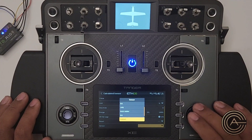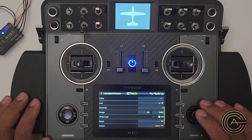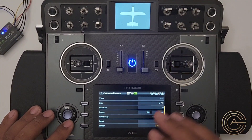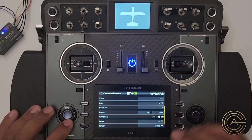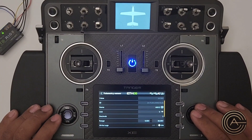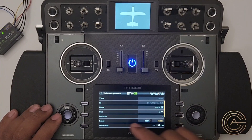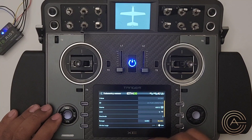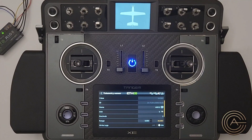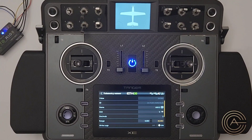At the bottom where it says 'sensor,' I'm going to choose the ADC2 sensor. It already came up with a number — 46 percent — essentially basing it on a range. To understand this, let's go back and edit the ADC2 sensor and look at that range. We need to calibrate it. For LiPo batteries, the usable voltage per cell is 3.2 volts at zero percent, all the way up to 4.2 volts — that's your voltage range.